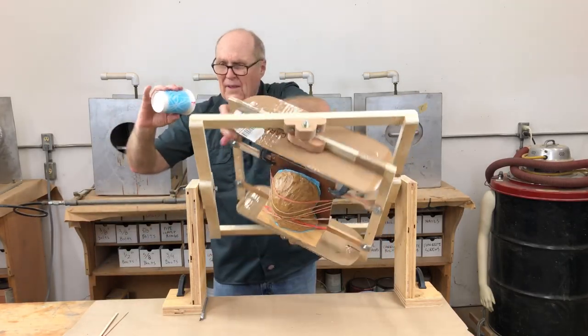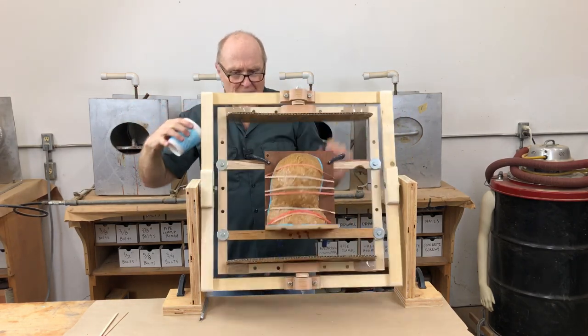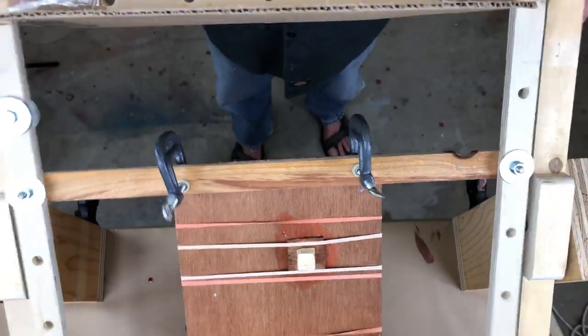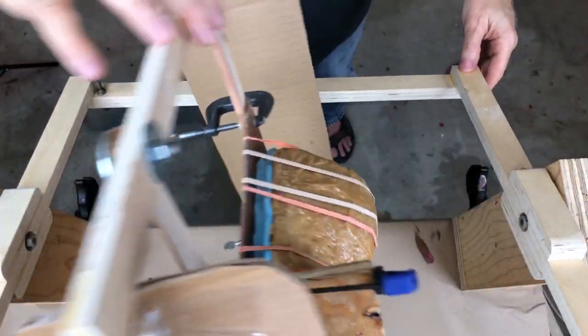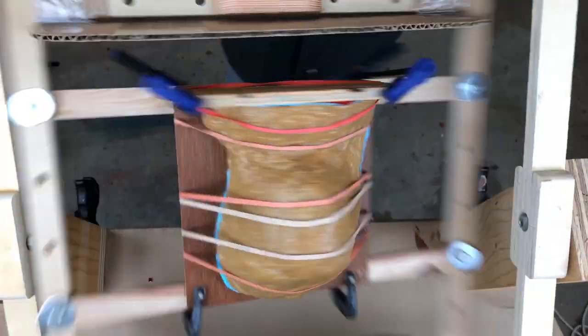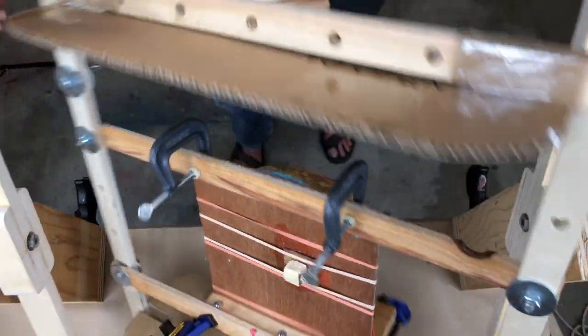If you put a large amount of resin in at one time, you'll always have a pool collecting in the bottom of the mold cavity — there'll be too much material for it to evenly coat. What I'd like to do is coat the interior without having any leftover resin pooling inside the mold cavity, because if it pools, it's going to cure into a clump like a baseball. I'm combining shots from each casting for the sake of the video.